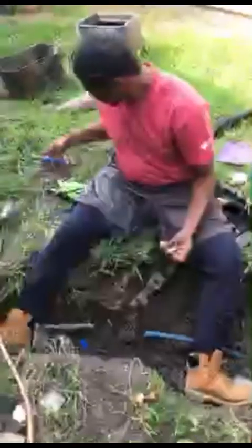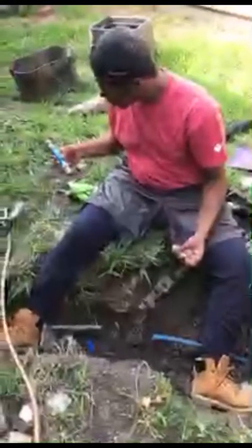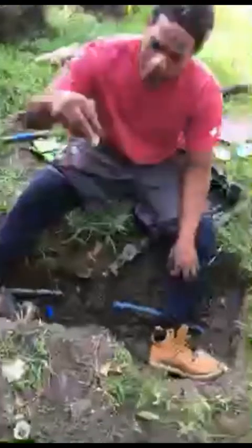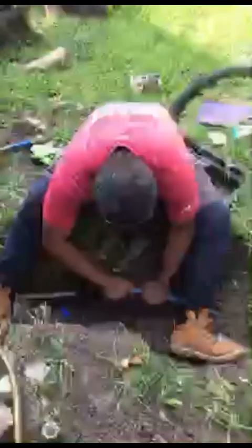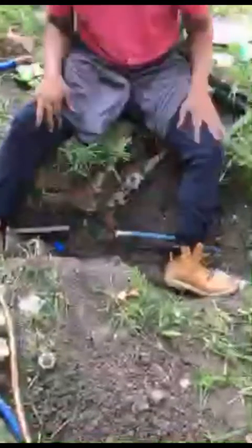Okay. Oh, you know what? I'm supposed to have PEX. Yeah. Oh no, that's the same. I think this piece just goes on the copper, but I think it'll hook the PEX as well. Cause when I hooked this piece up, and that's not even the one that was leaking, it was this one right here. So we're gonna go ahead, man, and fly this piece on right quick. So you just take this, the gray side, got a little grommet in there, and you wanna stick that grommet inside and over, just push it on there, just like that. It's on there.